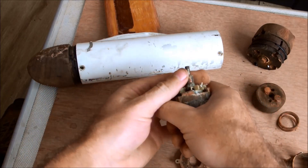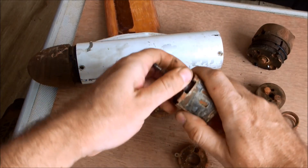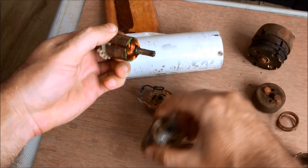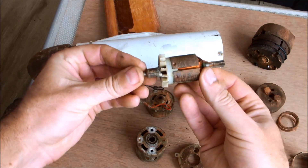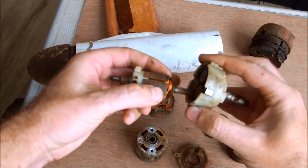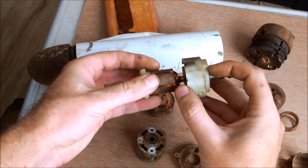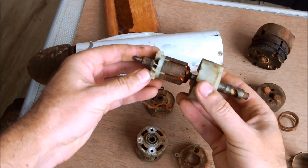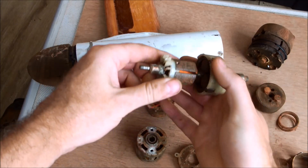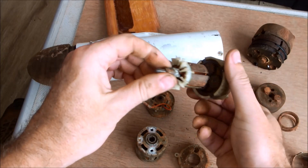Nothing to salvage there. The magnets are still nice and strong. This shaft with the sun gear and the gearbox could still be quite useful for future projects — it's a nice compact design, just one stage of planetary gears. I'll cut this short: put a small brushless motor behind this and that should make a nice compact design for an underwater trolling motor.